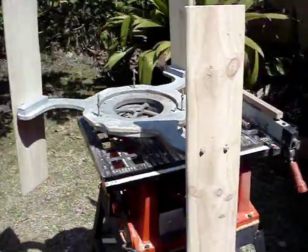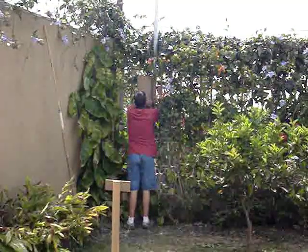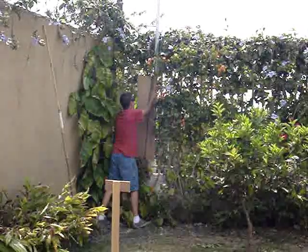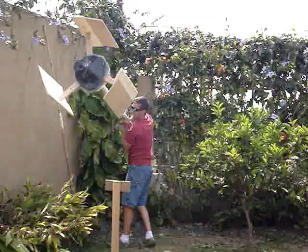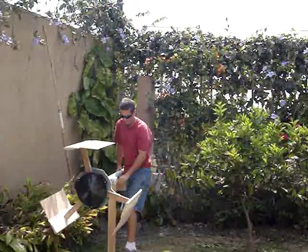Here's my first prototype. This is how I raise and lower my mast for the wind generator. I have two 5/8 inch wedge anchors in this concrete wall, and I just hinge it off the bottom one. I can slide it off to the side and hinge it down, which makes it easy to change out the generator or to experiment.